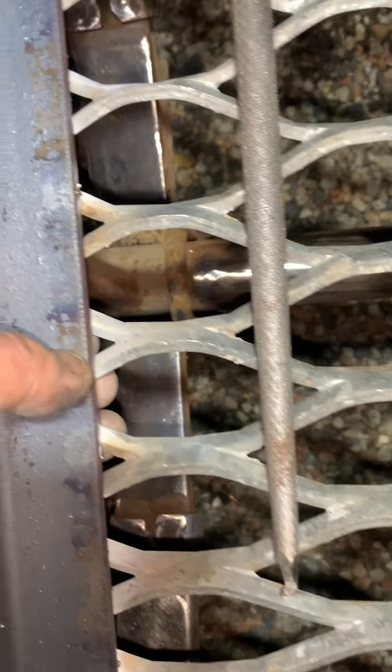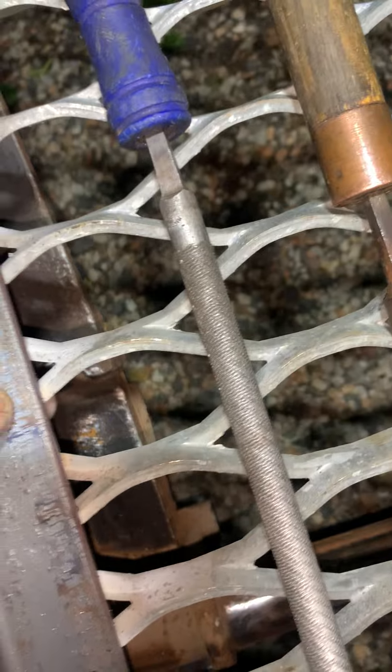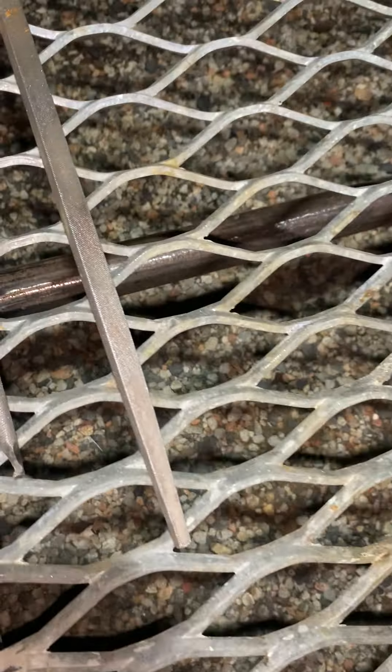The way I did the floor was I set it upside down and welded on one side, then the other. I missed a couple here, then the other side, and came up here. Don't start from the end — start from the middle and work your way out, otherwise it will pull. You can see it's pretty flat; I can stand on this and it won't budge.